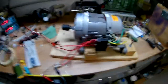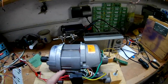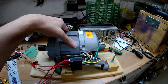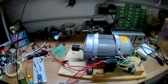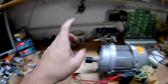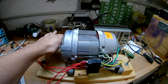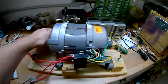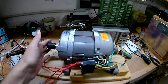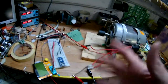The two white wires are just the thermal probe, and the other two are the brushes for the armature. I wired it up for DC, which means I have a constant voltage flowing through the field windings and I can vary the speed with the voltage for the armature - or armature, I think that's the word I'm looking for - the thing in the middle that turns.